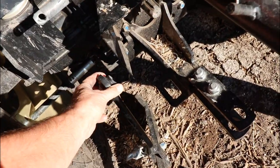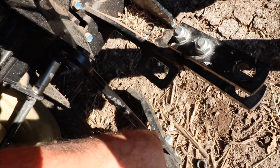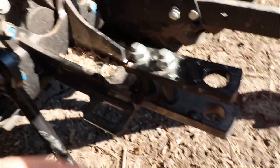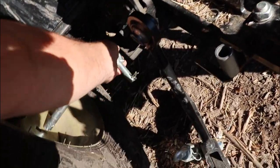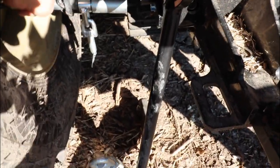I took the upper arm off — just pulled the little pin out so the arm would come up. That let this side of the three-point hitch come down. Now let's see if this will just — yep — just come right off. There's one bushing off and there's the broken part. That's off now too. So I'm gonna put the new one on. Doesn't look like there's any particular direction it goes. I'll put the new one on, put this bushing back in there, slide it over just a little bit, and now I can put the arms back together.